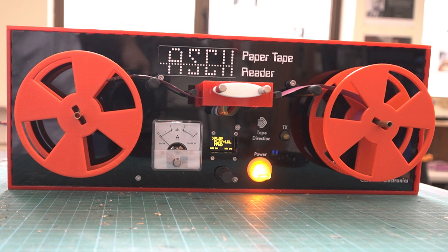On the far right is the static axle, which just stays still. Looking at the front, it has places for the reels, the reader head, and two adjustable turning screws that can bring the reader head forward or backward to align the holes more accurately. There's the ammeter, a cutout hole for the LCD screen showing the parameters as designed by David Hansel's firmware, and I used my Mini Pro to flash the microcontroller with the firmware from GitHub. There's a TX light that turns on when the machine is transmitting, a power switch, and I used Inkscape to create SVGs to make the front more aesthetically pleasing — including an arrow indicating tape direction and a graphic for the title.